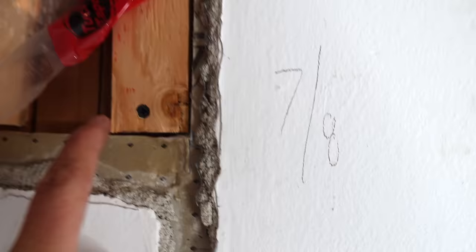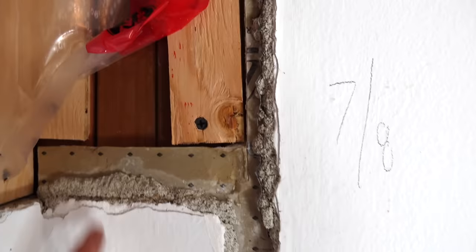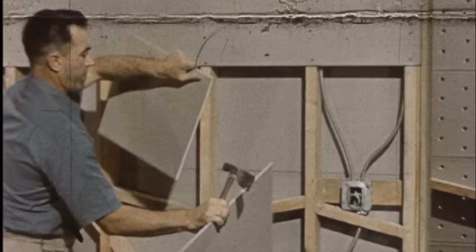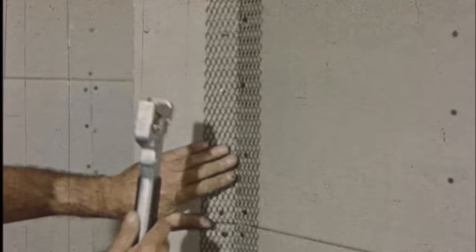I think it's actually a really good and strong method of plastering a house. As we can see, we've got this drywall installed onto the studs — it's about three-eighths of an inch thick — and they plastered over top of everything, about three-eighths to a half inch of plaster. In the corners they would still use the diamond lath to reinforce it. The lath in this case is not thin wood strips; it's three-eighths inch drywall, usually about two-foot wide panels, installed on all the walls, then plastered right over top using diamond lath in the corners for reinforcement to stop cracks.